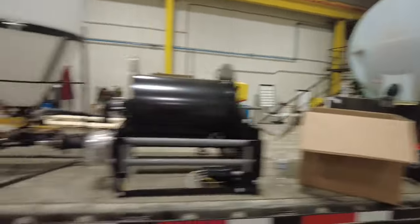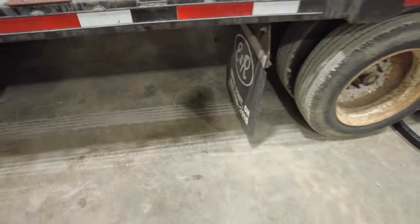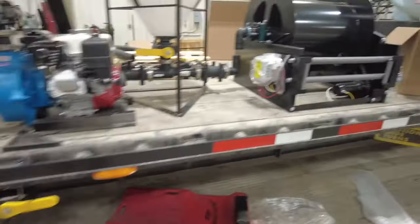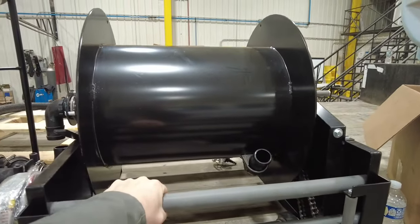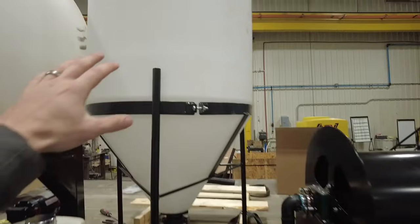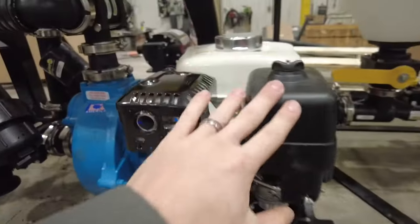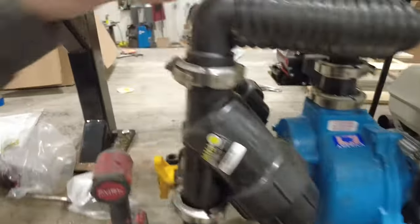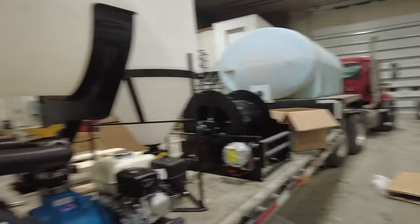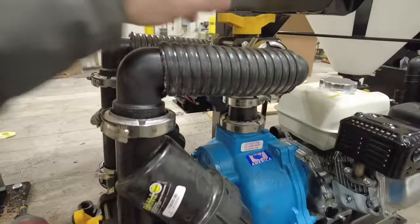He said, 'Adam, bring you both trailers, use your overhead crane, lift my tanks off my old trailer and mount them down to this trailer.' So that's exactly what we're doing. We've got the hoops bolted down here to the frame rail and we're starting to customize the liquid side. This one's being plumbed two-inch. We've got a remote-controlled electric hose reel right here — that's pretty well standard on every tender trailer. From there we've got our inductor mixing cone with everything plumbed in, direct to that hose reel. Honda motor with a John Blue pump, and this pump will have the ability to fill each tank on the trailer and also pump off into your sprayer, just by turning a few extra knobs.